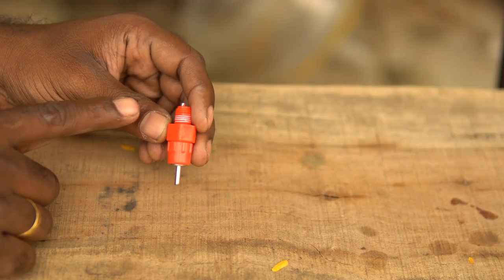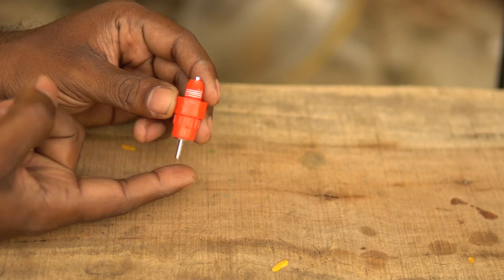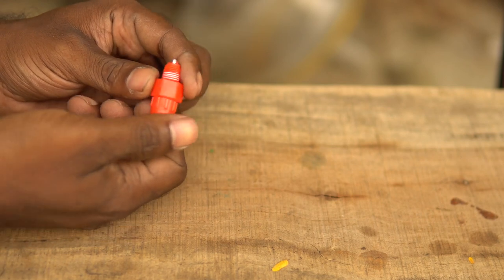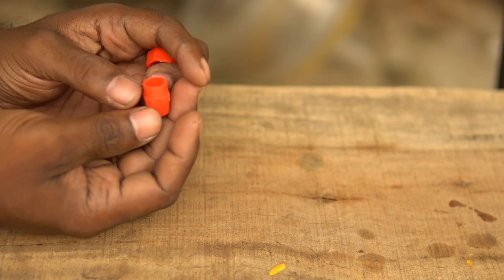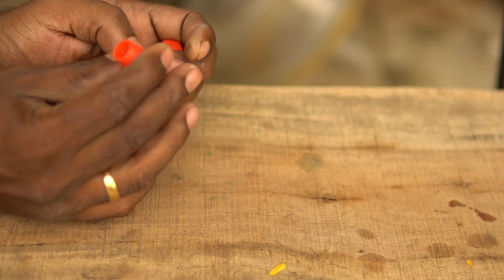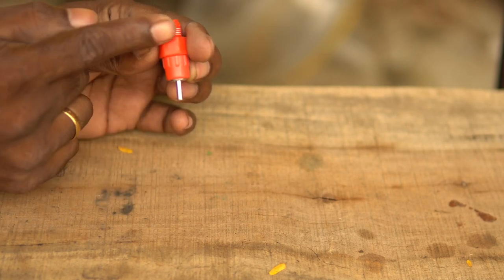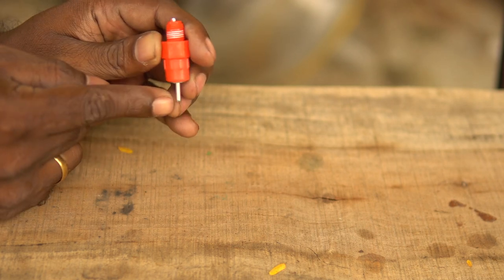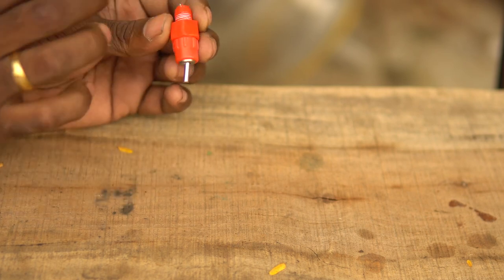These are the nipple feeders I've been using, and it's actually a really simple mechanism. Let me open this up and show you. There are two separate pins — one metal pin at the bottom and one on top. When you press the pin from the bottom, the top pin also moves in the opposite direction. In between those two pins there is a small metal ball sitting on a washer, which blocks the flow of water. When the bird wiggles the bottom pin, the ball moves and creates a gap for water to flow out through the tip. The top pin then pushes the ball back into place, locking the water flow again.